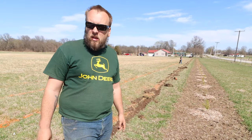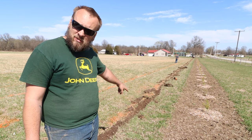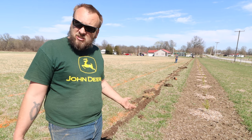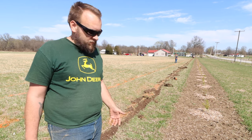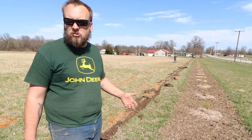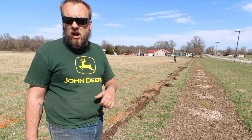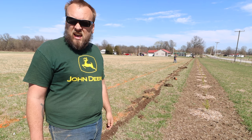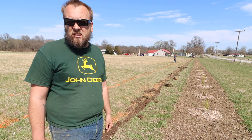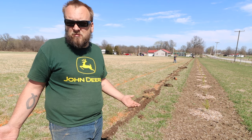He started up here and was just scratching a couple inches, then he adjusted the top link so it would dig in deeper. But his tractor didn't have enough weight to pull it. It's just a really small tractor and you need more weight. When he gets back up here, I'm going to see if he wants me to try it on my tractor. The tiller goes about six inches, so if the middle buster won't go deeper than that, it doesn't really help with what we're doing.